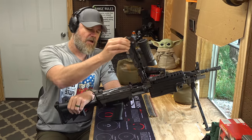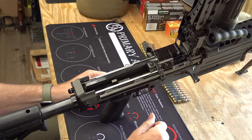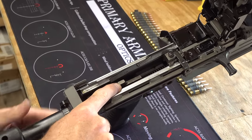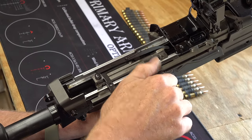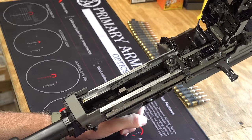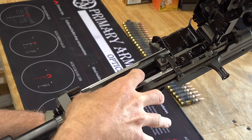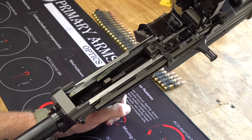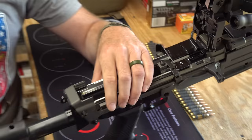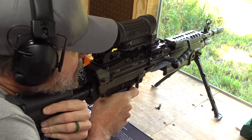I'm not going to go over the full mechanics of the SAW today — we've covered those in previous videos — but right here is your striker assembly. As I pull the bolt to the rear, you can see the actual bolt. On a full-auto gun, the gun would sit in this position and when you pull the trigger it slams home and fires a round. In the semi-automatic version, the striker stays to the rear. This entire mechanism with the extra springs is not part of the original design. When I pull the trigger and fire the gun, the striker goes home, fires the cartridge, and starts the cycling process. The SAW has a large enough receiver to accommodate the semi-automatic conversion.